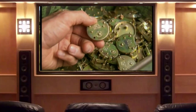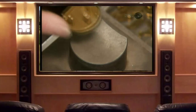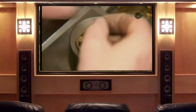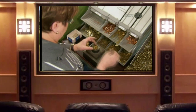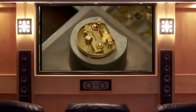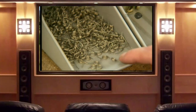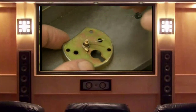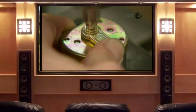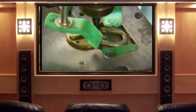The back of the lock body is now ready to receive the lock mechanism. There are 240 different lever combinations, and the next worker determines which one to use. She places the bolt lever in the casing and slides all the other levers onto a rivet — there are a total of six levers in this particular padlock, though some locks have more and some have less. The more levers there are, the tougher the lock is to pick. She wraps a metal spring around a rivet, then hinges the shackle to a third post. She sets the back half aside and assembles the keyhole cover to the front part of the lock, winding a spring around a post and placing the cover over it so the spring will allow the cover to be swung open and shut. A rivet secures the keyhole cover. She then brings the two lock body halves together so the rivets from the back protrude through the front, and flattens the rivets to hold the parts together.